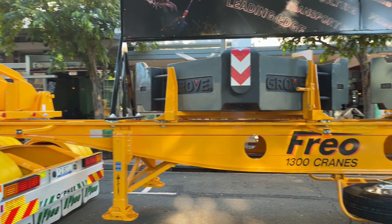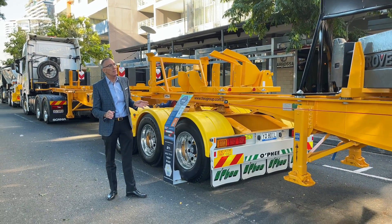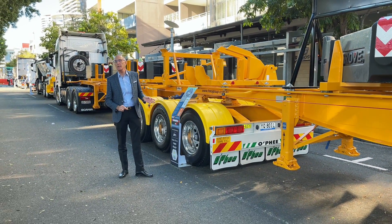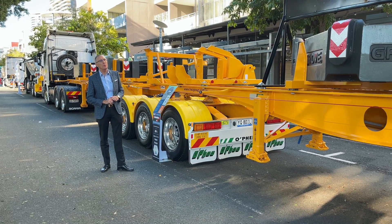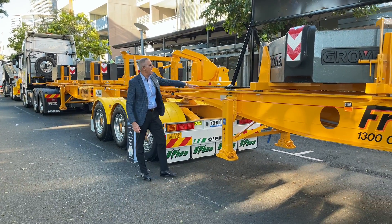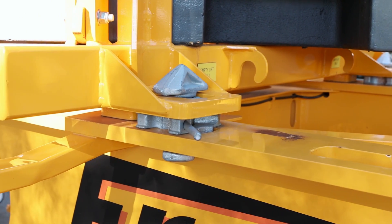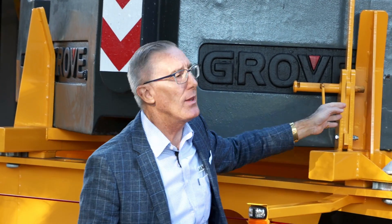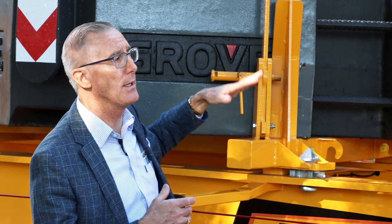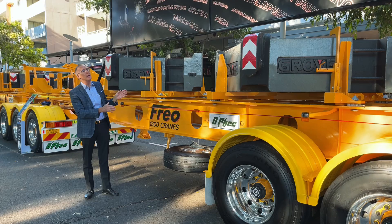There's another single sheave that'll go on there. The other main feature — over and above being a very versatile, useful crane combination that'll suit any crane — is that everything is operated from the ground. There is no need anymore to hop up onto a trailer, because we can unhook the cradles from the ground. Everything has load restraint via the ground, so there are no chains.